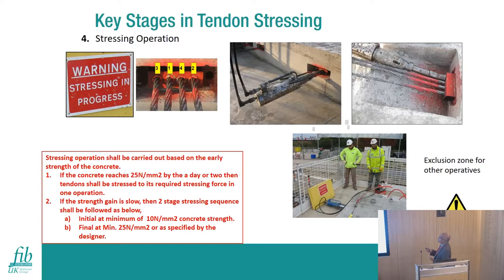At the slab edge, use a straight jack; where there are 'pants' or recessed anchors, use a curved nose jack, as a straight jack cannot fit. When designing a recess, account for additional losses from the curved jack. If you design for 80% stressing force with a straight jack, for a curved jack consider only about 70% for theoretical performance - but ask the contractor to stress to 80% on site, with that extra 10% absorbed by the curved element. Don't stand behind the stressing area. Initial stressing the next day avoids early shrinkage cracks and allows removal of any recessed formwork or polyfoam.